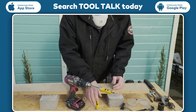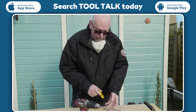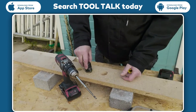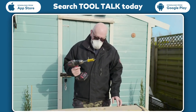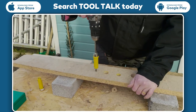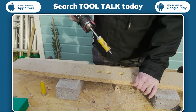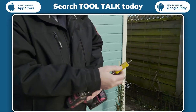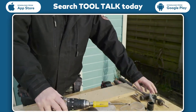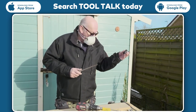I do believe that sometimes when you're cutting holes — it's happened to us — you've measured up and you're slightly out of line. What you find is, if you try to cut a bigger hole with one of these, you tend to skate and get off center, so your hole goes out of line. I'm impressed with the way this cuts through. In fact it's so good I want to give it another go to see if the piece of wood stays inside. And there it is — it's actually broken up into pieces — but if you just press the button and pull back, all the residue comes straight off, whereas with the other one you'd have to get screwdrivers to wedge it out.